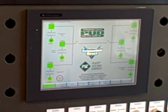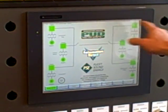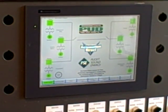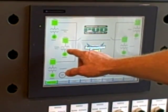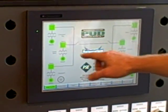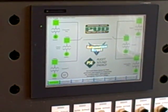So a brief overview. What this is right here is a single line diagram showing all six generator stations in our lab. Each generating station outputs three-phase power to the tune of a couple hundred watts per generator, so it's a very low power system. Each generator has its own step-up transformer and then a circuit breaker to tie to the grid, and then the grid will eventually have a pair of disconnects and a transmission line that links these two sub-networks together.